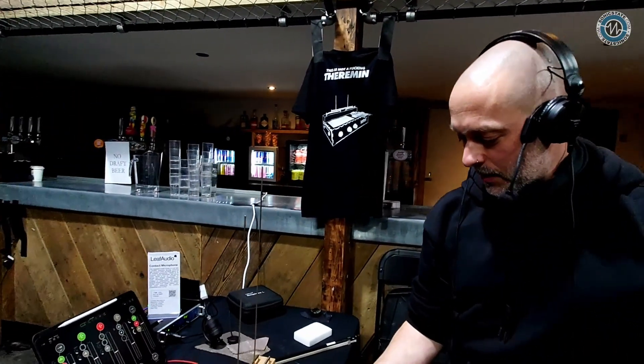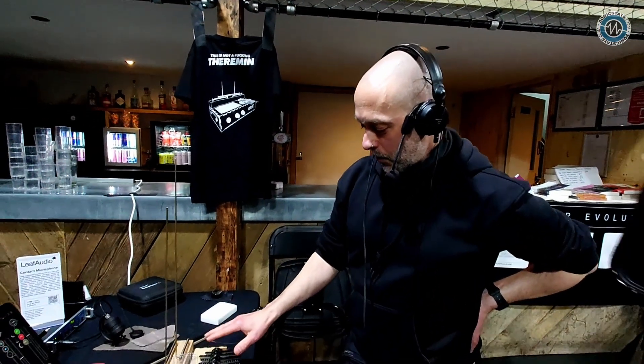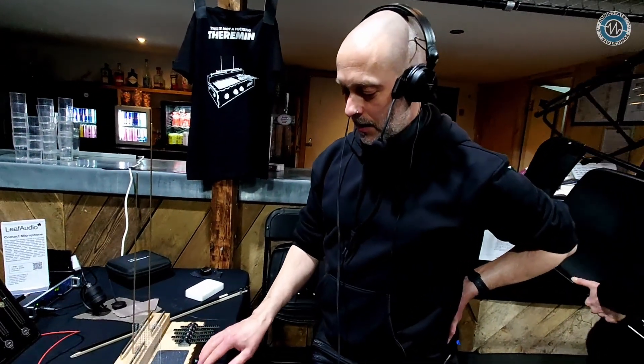Yes. When we started with the sound box, I've been working with contact microphones since the late nineties. I made my first sound box in '97 and since then I was working with it in my own music. We really engineered a product out of it and realized the preamps are really important. The trick is to find a good piezo element as a contact mic — not these Chinese no-name ones. We selected really good ones from dozens of variations. We made a preamp which is impedance matched to the contact mic. This really is the trick. If you connect a contact mic directly to the RME inputs, it sounds way worse — not because RME is bad, it's just not matched.